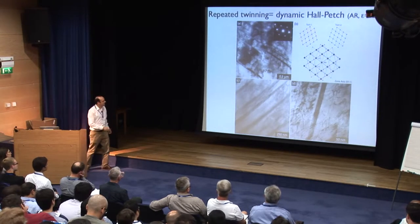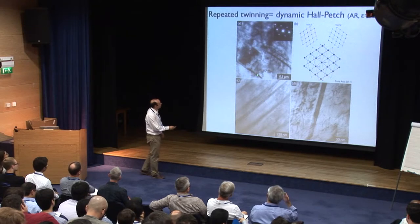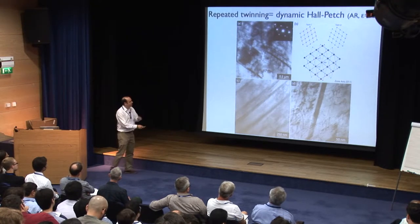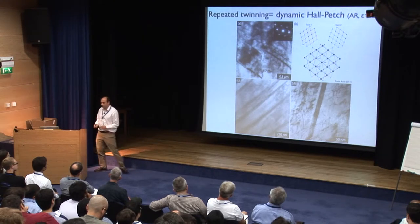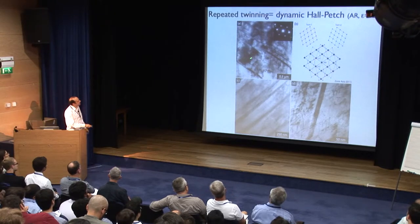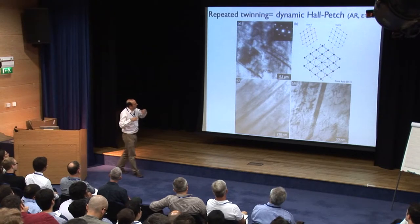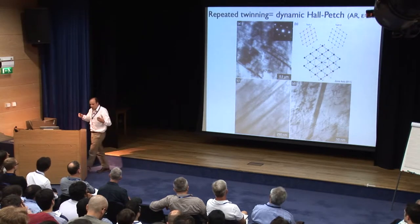That's the key. The key to these is that the partial dislocations are sufficiently spread out and sufficiently confused about where they're going, simple picture, terrible anthropomorphism, etc., that you can condense into a whole series of different twins. And that's the magic. So now the question is, people have shown that this works nicely in things like high-speed tensile tests, in Hopkinson bar tests, shown that they work for things like vehicle crashes, which is originally what they're really aimed at. Now, do they work in blast?